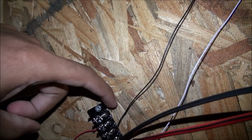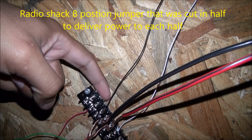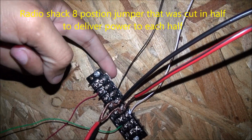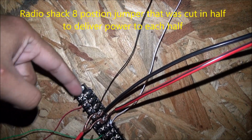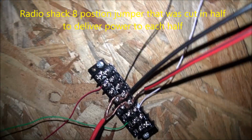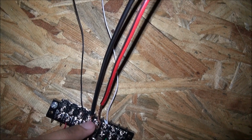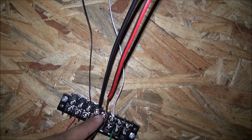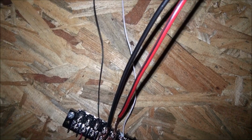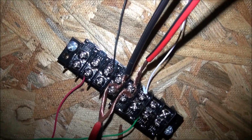Now these are jumper strips, and these actual jumpers will carry the power further. And if you want to make your own, you just take some wire and wrap it around each one of those past the barriers. But they're called barrier strips because you see barriers keep the electric current separate. I don't have the spade connectors on yet. However, you can see that there's fringing wires, and you really want to use those spade connectors. But even this barrier is keeping those wires from touching each other, which helps make sure the current stays separate between the outer rails and the inner rails.